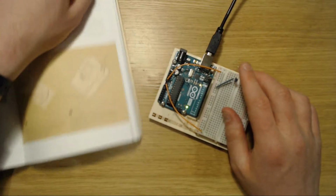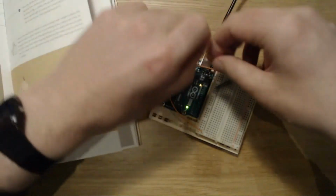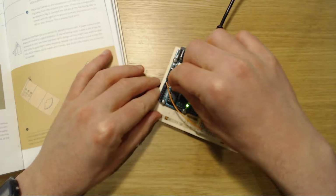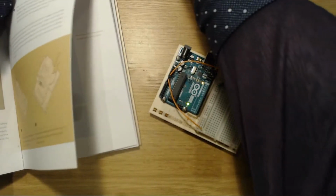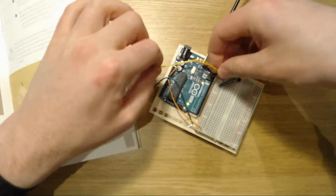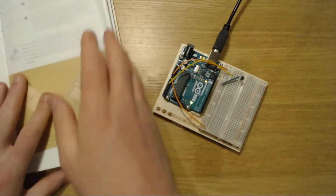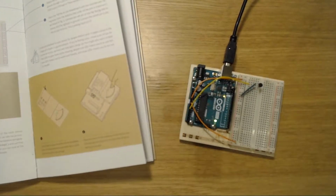and the key thing is that when you press this, a different value comes out of the middle pin. So let's hook this one up to the middle pin, and the other side up to A0, and it's just falling short. Okay, don't worry, I've got longer ones. Well, the kit supplies the longer ones. So 1 in 3, which is the middle one, and the other in A0. Okay, now there's more to build, as you can see from here. There's stuff involving lights. But now that we've got this one done, let's just skip straight to the dev environment.